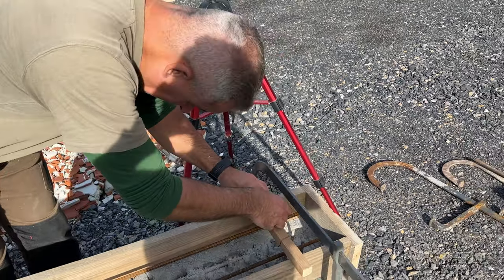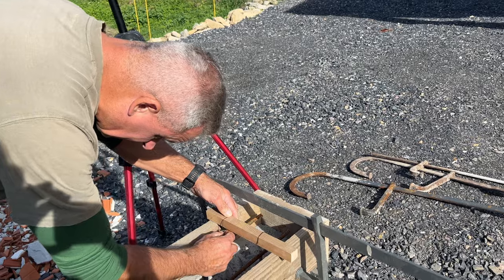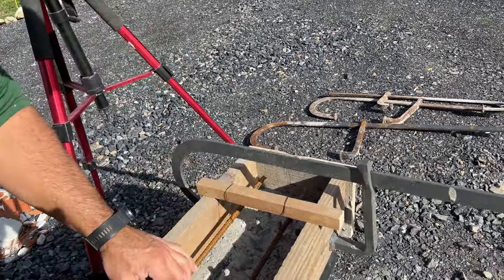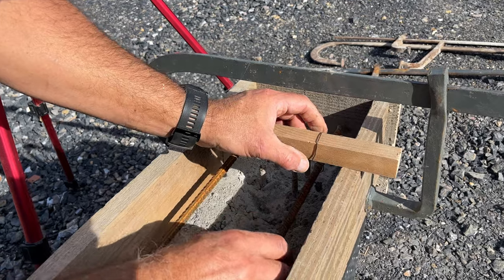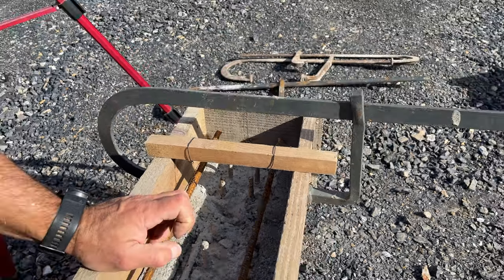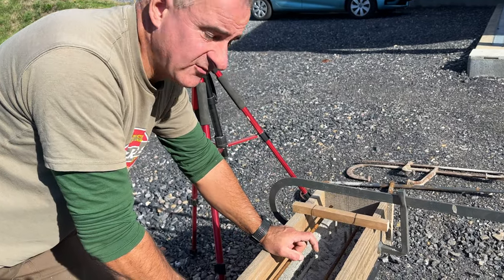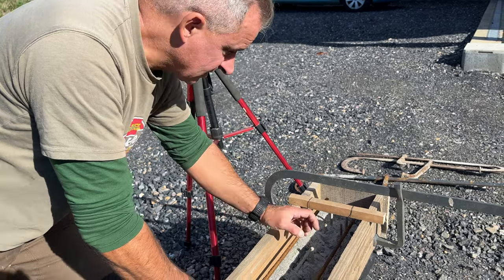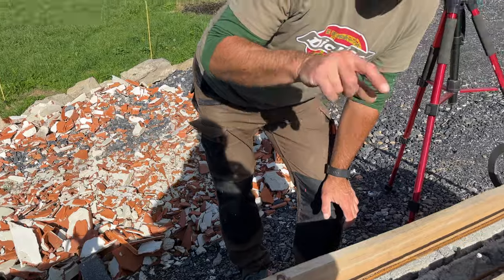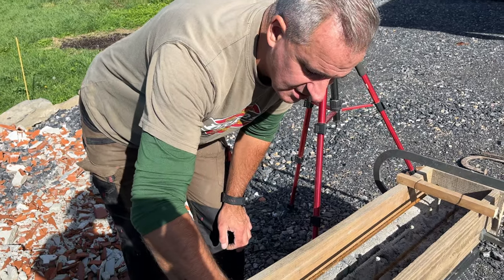Once the concrete's in, I can just take these hangers off, snip the wire, take the hangers off — and we should be okay. They're basically hung one inch from the top, one inch from the corner. We're going to put in those little microfibers as well into the concrete just to make it a lot stronger, and some hydrofuge — hydrofuge to make it waterproof. I'm going to put a series of these hangers all the way along just to suspend this. We could actually push it in afterwards, but then you never know how far or how deep you push the rebar, so it's just more precise to prepare before you actually do the concrete.